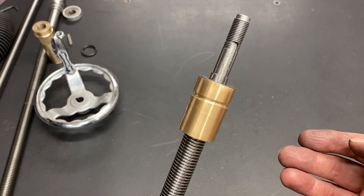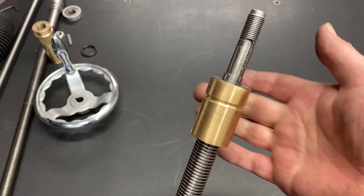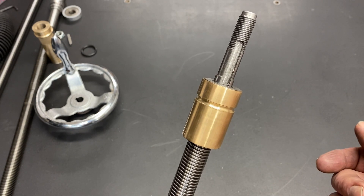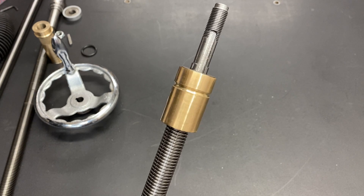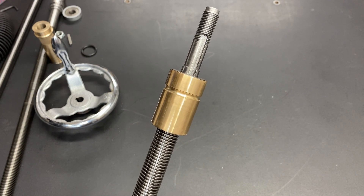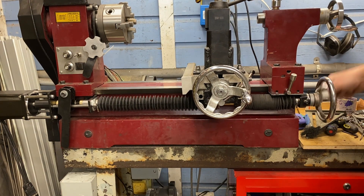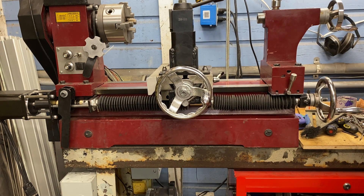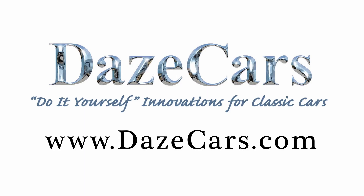I just want to show how smooth the action is on this with the 3-bearing system. That just spins extremely well. And by being able to use the threaded end to adjust it and get all lash out, it will make the hand-wheel end of this lathe spin so nicely. The new lead screw is super smooth, and with the lead screw covers it should stay that way for a long, long time. If you like what you've seen, please click like. If you'd like to see more, please subscribe. Thanks for watching. See you next time.